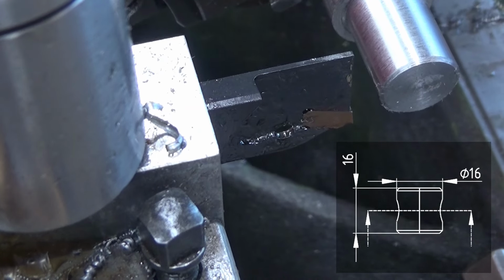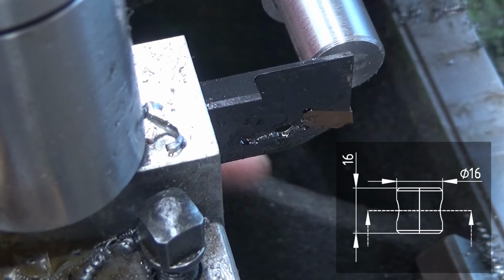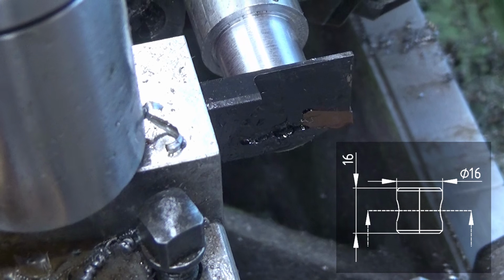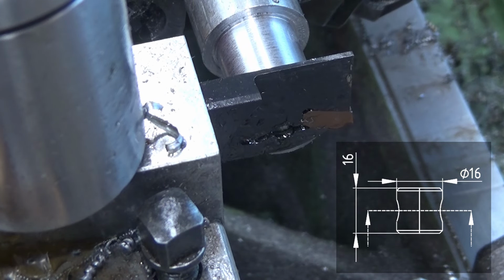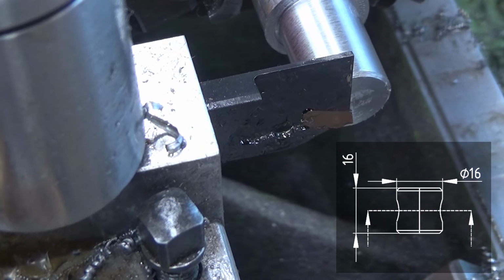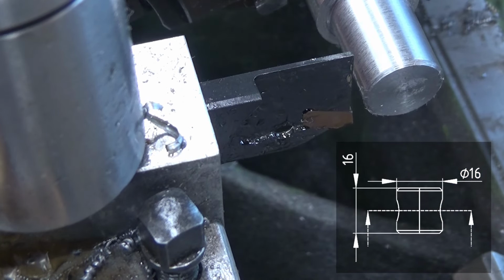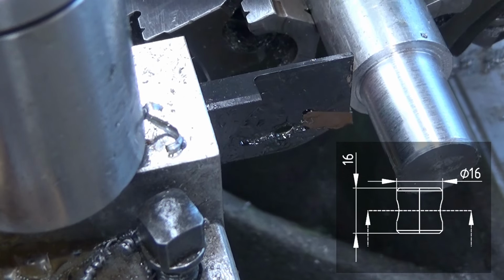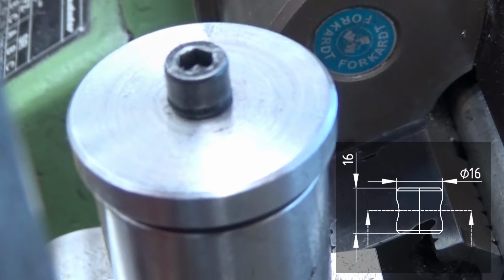So when I measure these, I never touch the end with the blade, but with this body, like that. Now it's there, and I can reset my, what is this, travel indicator? Yeah. And once again, this dimension is not critical. It just needs to be something. So, now 16 millimeters, so 18 millimeters, because the plate width is 2. So 18 here. And then I feel here something.